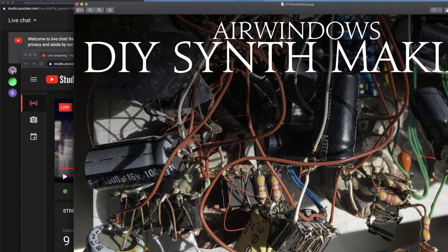Like over here in the corner, you can see these are also capacitors. They're polystyrene film capacitors. And I've got them wired up in an interesting way, where they're kind of in parallel, but there's also a resistance that comes in. I'm producing an interesting sort of filter that way, which is a high-pass filter, but it also has an interesting arrangement of where the poles are on it. These orange things are tantalum capacitors. I have a bunch of those too, and we're going to be using those going forward.